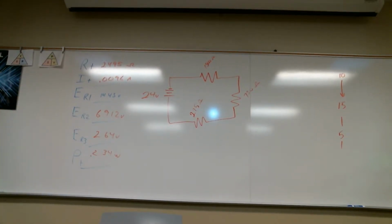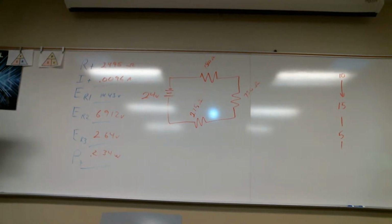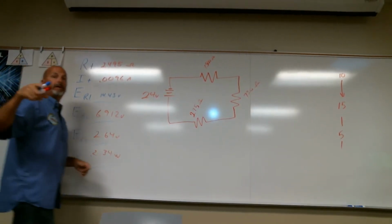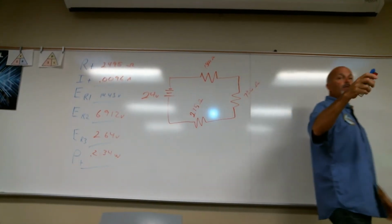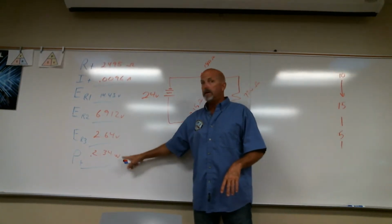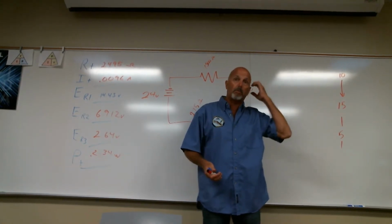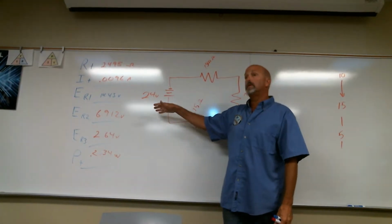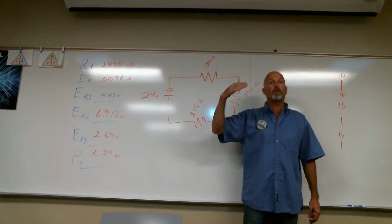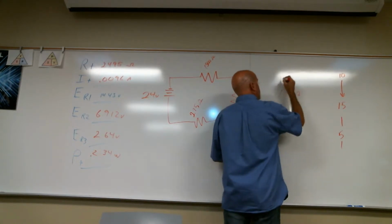Is that the ultimate outcome? You have an appliance that needs power, and you're just trying to essentially get to the correct power. What I'm trying to do is teach you Ohm's law so you see how all of these work. Now, if you buy a new water heater for that trailer you're working on, it's going to tell you that it's so many watts. And you know that your power supply is 120 volts. So now you can very quickly learn what type of breaker you need. Or if you have a breaker already in the trailer, suppose you have a 15 amp breaker and you've got 120 volts.